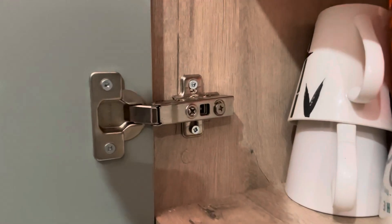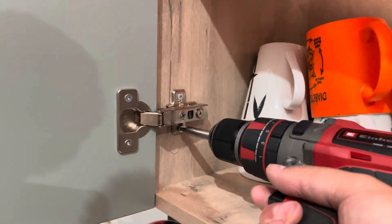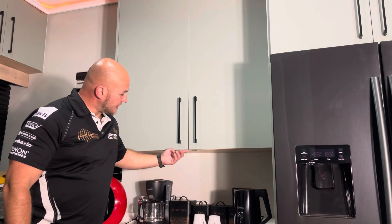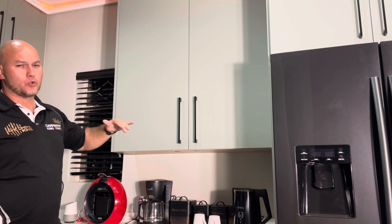As you can see I have gone up now, I have lifted that up and the door now sits nice and flush at the bottom. So now you just continue — you don't even need to hold because that is already been forced up. You just re-tighten all the screws. Look how nicely that is lined up there now, it is lined up nicely. My gapping on the side is also beautiful, so all the gaps are good. You do that for all the doors as you go.